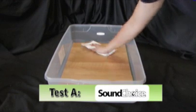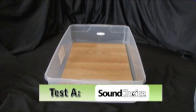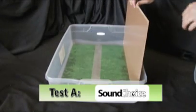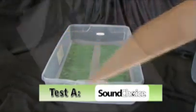After 30 minutes, the water on the surface of the flooring material was dried with a paper towel. The laminate test floor was lifted from one side. There were dark areas below the blue vapor barrier that appeared to be moist. However, both the underside of the laminate and the top side of the underlayment were dry to the touch.